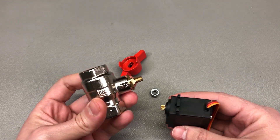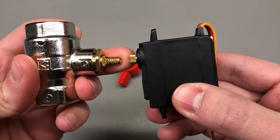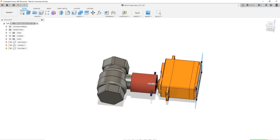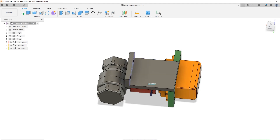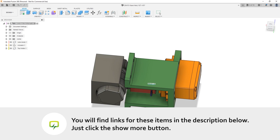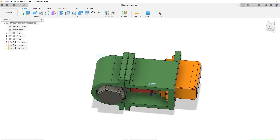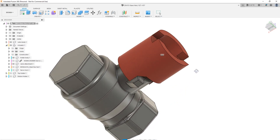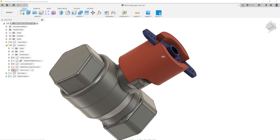My plan was to create a mount that would keep a servo motor aligned with the valve. I designed a two-piece model with a holder for the servo motor that clamps around the valve body. Since this was designed specifically for my valve and servo, you may need to make changes, but I will provide a link to the design files in the description. I also designed a small adapter piece that goes on the valve shaft, providing an interface to the servo horn and featuring an end-stop pin to prevent the valve from spinning more than it should.